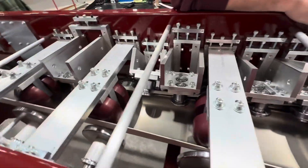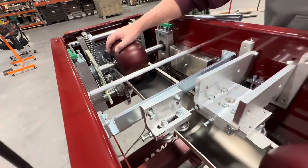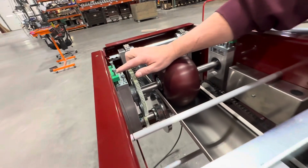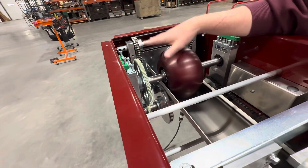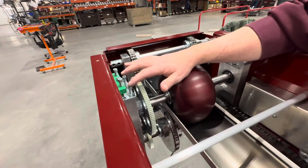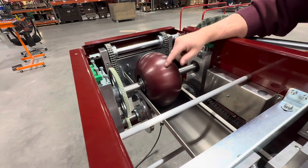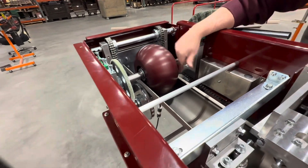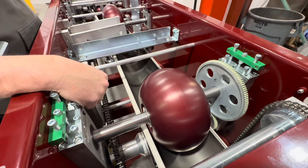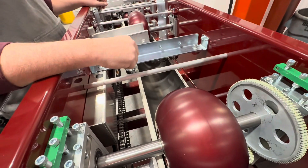This adjustment is really the only one you're ever going to mess with. I've never had to have anybody adjust this bead roller. If you do, it's only the green block controlling up or down on the gutter. The gap between these two rollers is only about 13 to 20 thousandths of an inch — if you put half a turn on it, this roller hits the other one. Never mess with that one. It's set it and forget it.